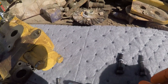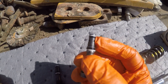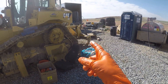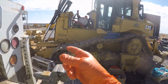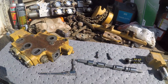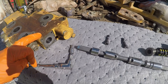This is what Caterpillar calls a shuttle valve, but just on this end of it, right inside there, there's a little check ball — that's your resolver. That's what tells the pump to stroke up. When I would deadhead the rippers all the way up, it would tilt fast because it has full system pressure. The resolver in the tilt circuit was telling the pump to go full — sorry, the ripper circuit. Anyway, when you let off, it would go right back down to just standby pressure, about 200 psi, trying to tilt.